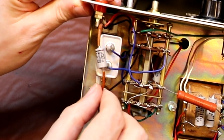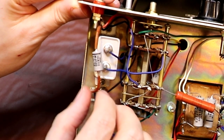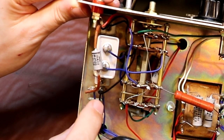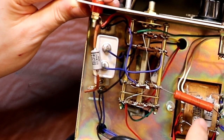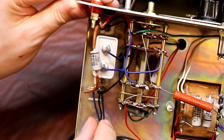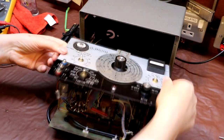I've just noticed that we've got a capacitor that's fallen off here. This one is another 600-volt, and I think it's a 10 nanofarad capacitor. Seeing as it's fallen off its terminal it might be worth doing an insulation resistance test on it, because it looks like the same type as these paper-oil ones down here — so we can see if there's any leakage. Regardless, we will replace these anyway.